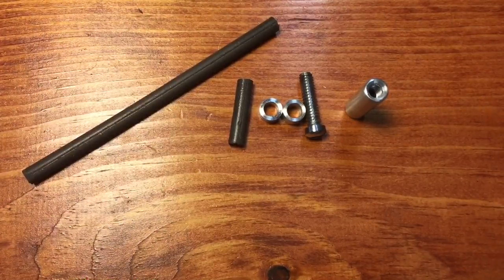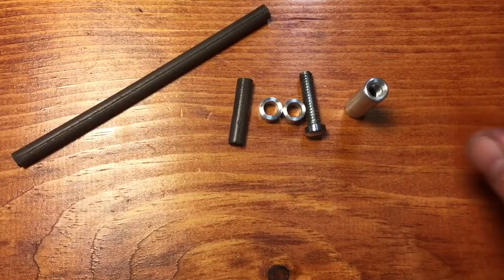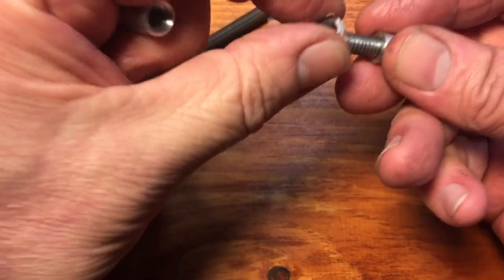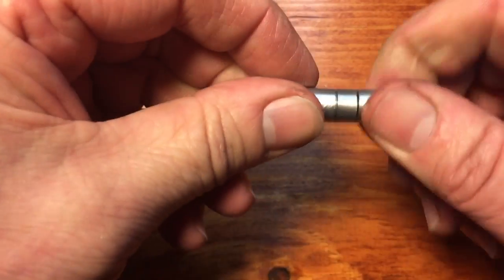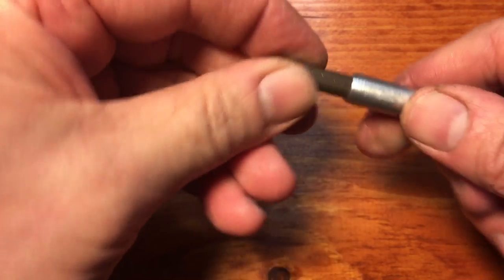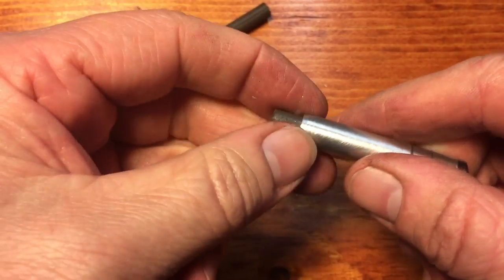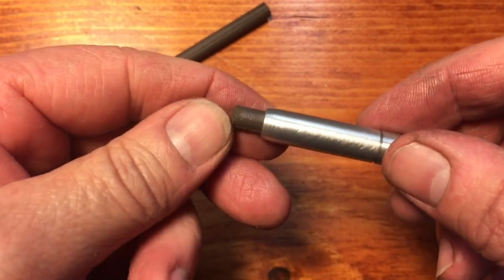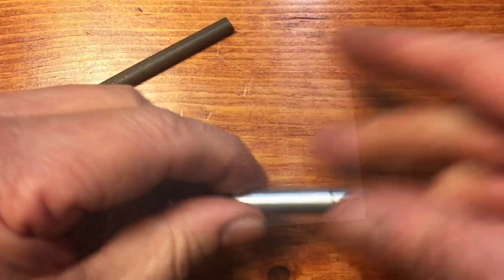Now I don't have a lot of experience with Cratex in this form, but I do know it isn't cheap — it's $8 for this one quarter-inch rod, and it goes up more the thicker it is. So that's why I made this little tool. What this tool does: I made these little spacers that go on the screw here. I turned down the head of the screw so it's smaller than the spacers, as you can see. That screws into the threaded one end. When it's nice and tight, this little piece of Cratex will fit in here as a press fit — you just squeeze it in until it can't go anymore. When it wears down, instead of throwing away the whole piece, you pull out one of these spacers, move it back down, and you can work it all the way until it's almost a half inch, then you have to toss it. Let's give this a try — should give it a little more stability than just the stick alone. We'll try it in a drill.